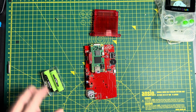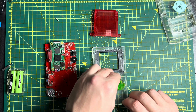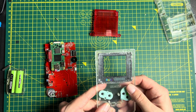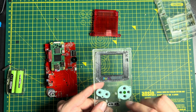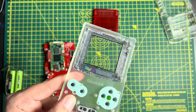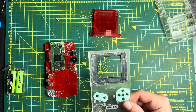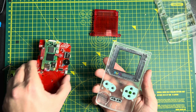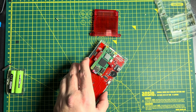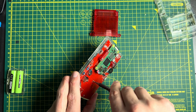Let's shell this thing inside a Game Boy Color shell. The first thing you need to do is pop all your little buttons in. You could use an original Game Boy Color — there's no reason to stop you — but these third-party aftermarket cases are much more available. There is a little bit of work you'll have to do to remove a little bit of plastic around the screen area at the top and bottom. I've done several tests and I'm confident I can put together a video tutorial on how to do that with nothing but a pair of flush cutters. We can go ahead and pop the motherboard inside, making sure the speaker's in there.